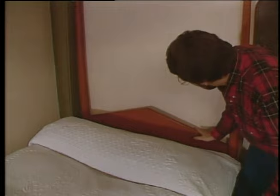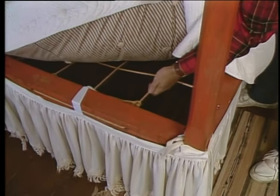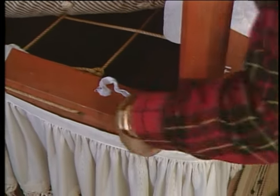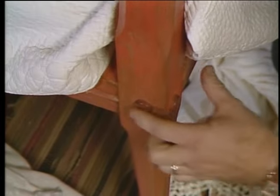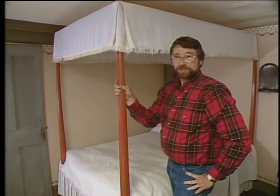Let's look at some of the details. The headboard has this nice triangular shape to the top of it, and it seems to be just mortised into the post. It has a rope spring and a nice three by three frame, good and heavy, which is just mortised into the post. Everything is held together with these metal fasteners, some kind of screw. The post is interesting — it's square where the rails come in, and below and above it's tapered on four sides and then it's chamfered, giving it eight faces. It also has kind of a nice color.